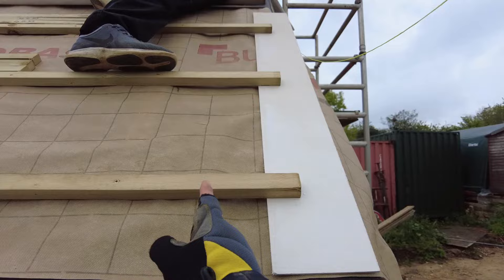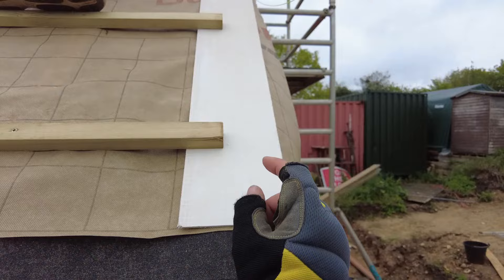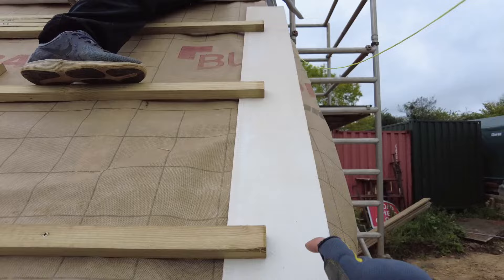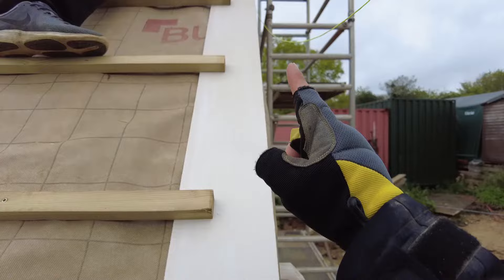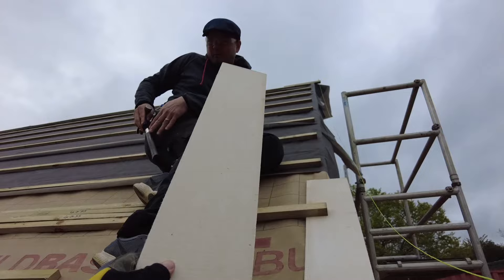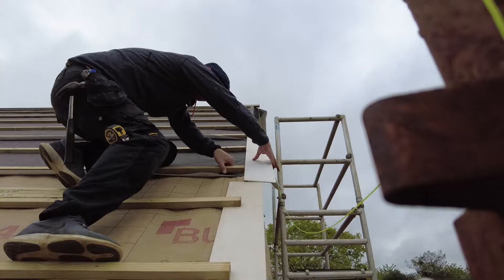We've put this one in — we've slid it across. You basically lift the ends of your battens and slide it in. It's much easier if you haven't got as many battens and you don't come all the way across. We've come to the ends where our face is going to be and then you just tap it across — you can use a hammer but just gently. We put the rough side up because the mortar is going on here and the other side is a bit smooth. We've lined this one up — 65mm off the edge of the last rafter — and now we're going to bang in a clout at the top and at the bottom. Dan's going to roughly get the other ones in place, and once we get to the top we can line them up properly off the string line.